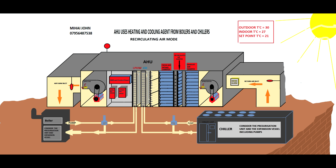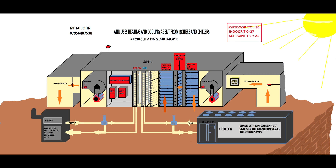The fans start to circulate, but it is very warm — you are just circulating warm air. Outside it is 30 degrees, so you cannot bring fresh air freely. That is why I use the damper at only 10 percent: I bring in 10 percent fresh air, extract 10 percent, and circulate 90 percent of the air. But the air is very hot, so something needs to be done.